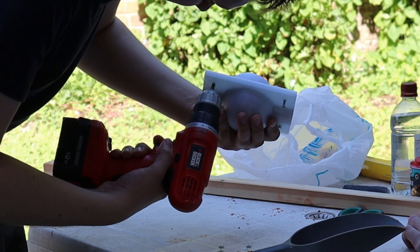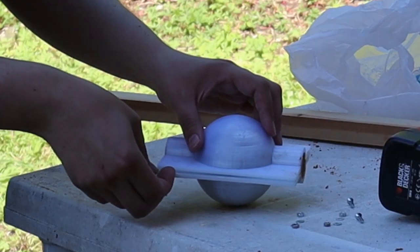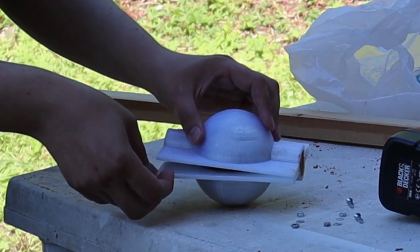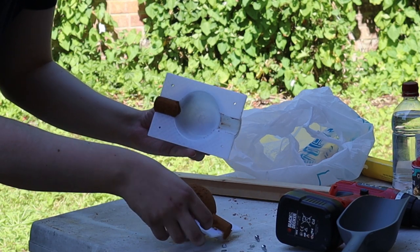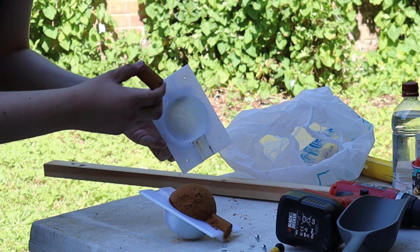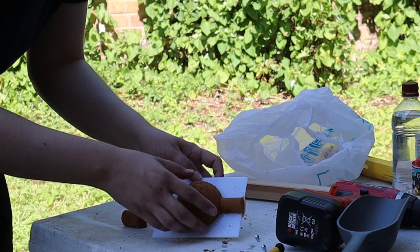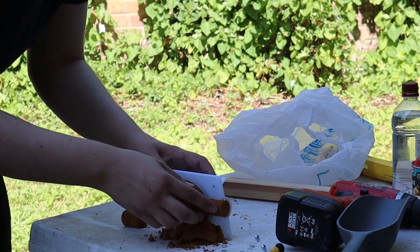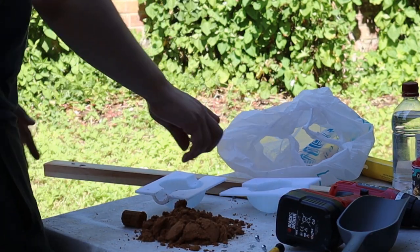After an hour of being left in the bag with the CO2, the mould was opened. The core was a failure on two counts. Firstly, the CO2 hadn't penetrated all the way through the part, so the innermost sand hadn't hardened. And secondly, I somehow hadn't noticed there was a slight undercut on the edge of the mould due to the 3D printing, which gripped into the core and tore it apart when the mould was separated.